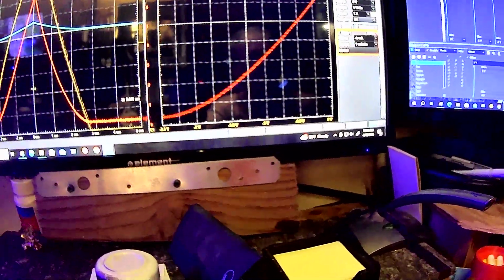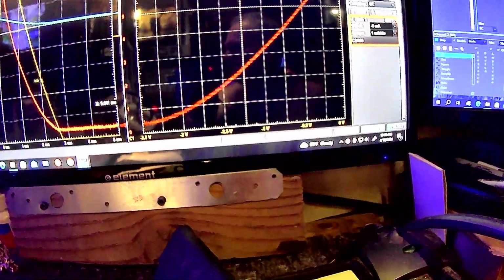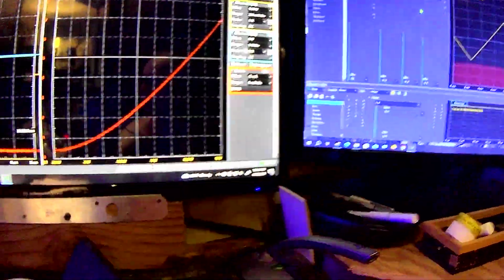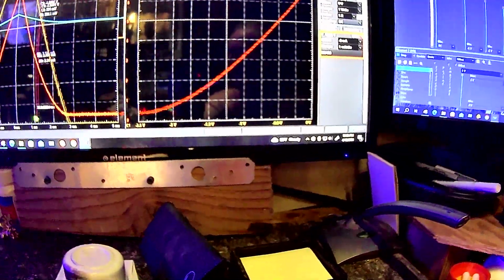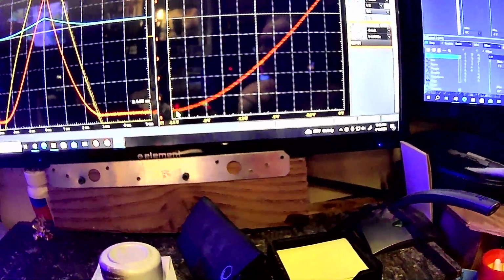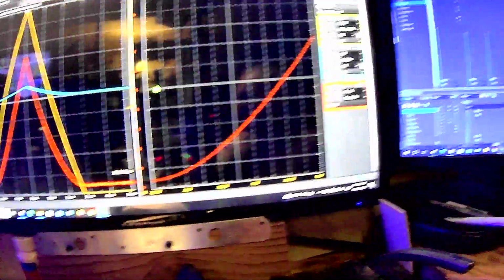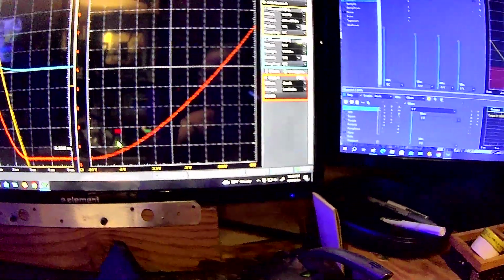I guess it's just not going enough to completely turn the thing off. But I think that's about as far as I could take it. I could probably try to tweak it, but I don't think the thing's completely turned off at 2.5 volts. But then again, I don't know, this thing was generating a larger voltage, so for some reason there's an offset, and I haven't figured out why that is. Because this curve, it's flat. I had it plotted out over to negative 5 volts originally, and it's just flat, and this is as low as it goes. So it's like the current never quite goes to 0, but I have a feeling there's probably some errors in how I have this set up. This is just an initial quick and dirty test I did. But at any rate, it's still more or less a classic transconductance curve for this particular device.